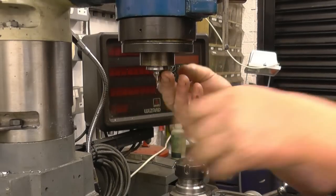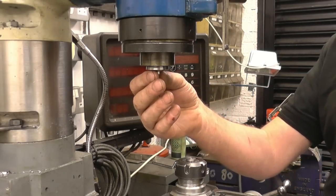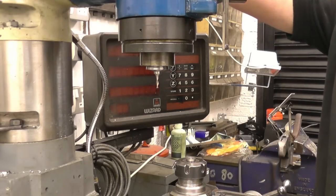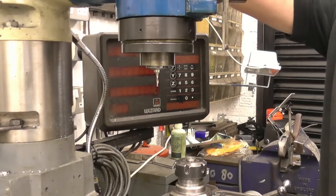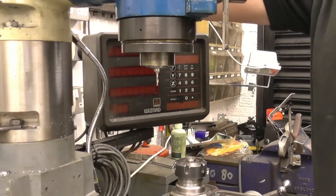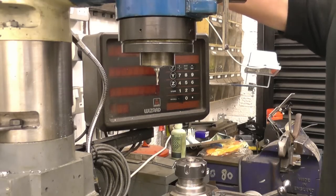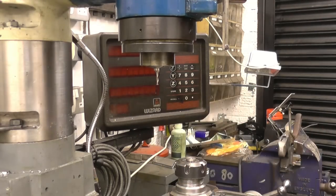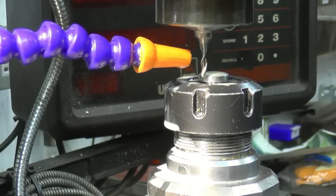One thing with small milling cutters — they've got to be run fast, very fast. The smaller the cutter, the faster you run them, and they haven't got a very long life expectancy. This machine will do 2,300 RPM and I'll be running it at 2,300. Five or six thousand would be better for that size, but we're all set up and ready to give it a go.